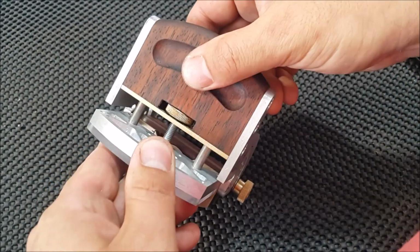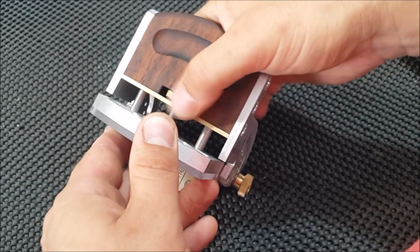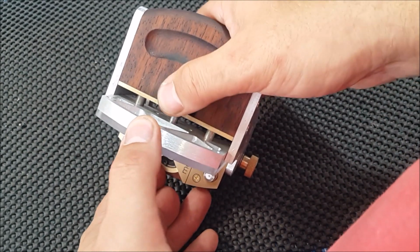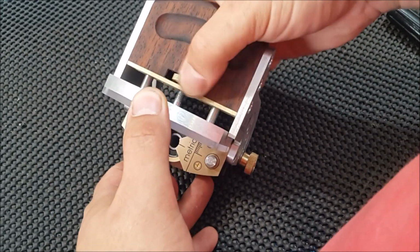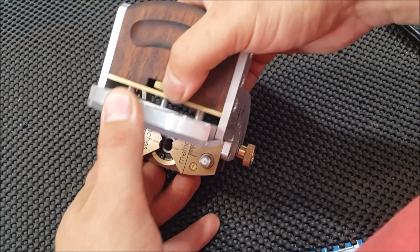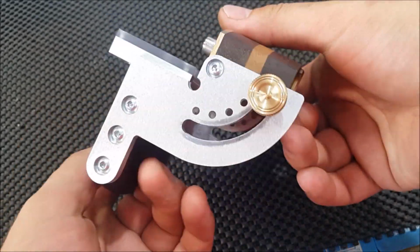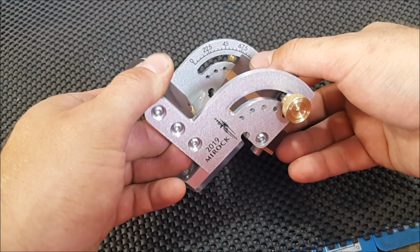Here is no play in this mechanism because inside are fluoroplastic tubes, and no play here. Pretty tight. This wheel rotates a bit hard because of a rubber circle inside to prevent any backlash, any play, and spontaneous unscrewing. When you work, you will be sure it will not change size without your wish. Let's try to drill something.